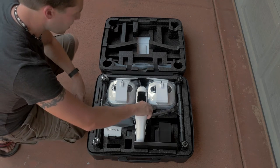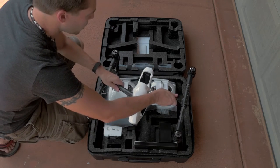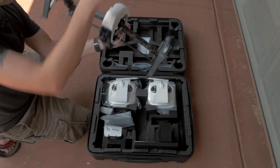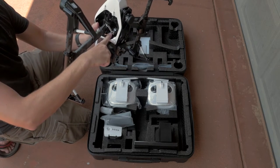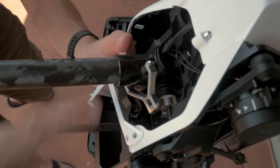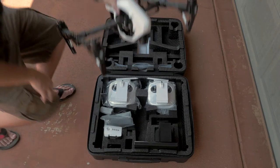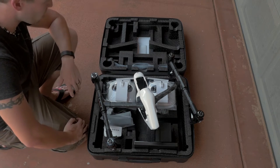Let's get right to the heart of the machine. There have been four different iterations of the Inspire 1 since its inception. The version 4 — how we can tell — has a one-piece yoke at the bottom. This one-piece machined y-yoke is probably 6061 aluminum, maybe 7075, we're not sure yet. That's what delineates the version 4 from versions 3, 2, and 1.